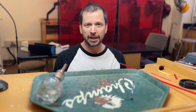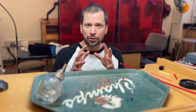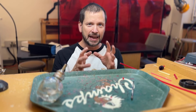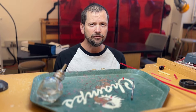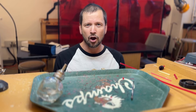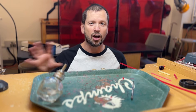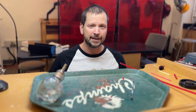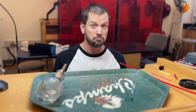There are other videos relating to this whole process, but we're just going to focus on sprueing — creating a system of pathways for the metal to get to your wax piece in order for it to be cast. For beginners, sprueing can be a little confusing or even overwhelming, mainly because you have to think about three different stages of the lost wax casting process and how you want to design your sprue system so that all three stages are successful.